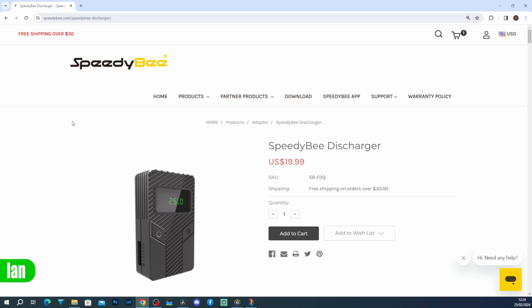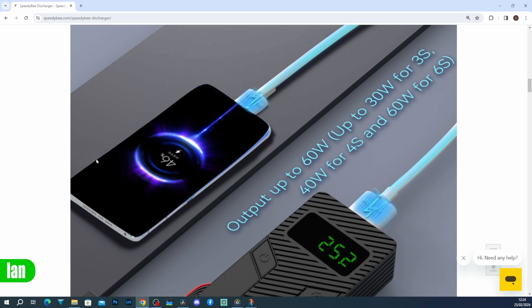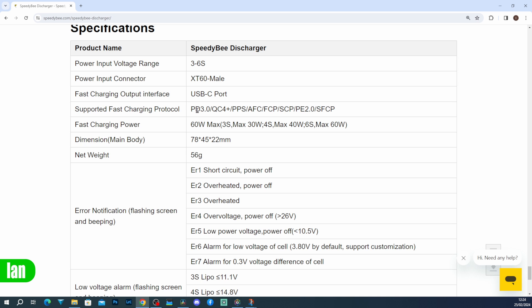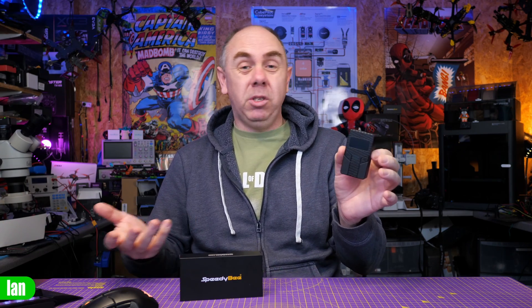It's not a bad device, just certainly not the easiest I've ever used. Price-wise, this is actually very cheap — it's under $20. For that, you're getting a device that allows you to discharge up to 6S batteries and output up to 60 watts via the power delivery protocol. At the bottom of the page, you can see it supports PD 3.0, QC4+, and all the other options. You've got 60 watts max on a 6S pack, or 30 watts max on a 3S pack. It weighs 56 grams, and the Speedybee website lists all the error codes. I would have preferred the device cost a little more and have a proper display. If you need to discharge batteries and use that as a charger, it's worth a look at less than $20 — not bad for the money, though it's really not perfect. If you're interested, there will be a link in the description.